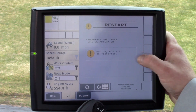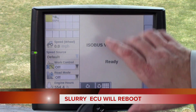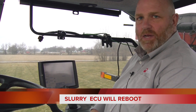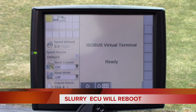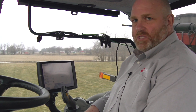Hit the back key and you will notice that after you change the width, the ECU will actually reset and you will get two windows that come up telling you the Mueller ECU is not talking to the tractor or the display right now. You will see an icon that looks like a floppy disk — that means it's reloading the object pool onto the Pro 700 or Intelliview 4. This takes 30 seconds to a minute depending on how much information is on your Pro 700 or Intelliview.